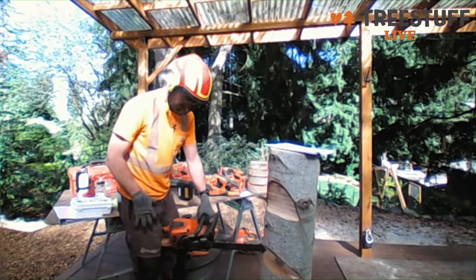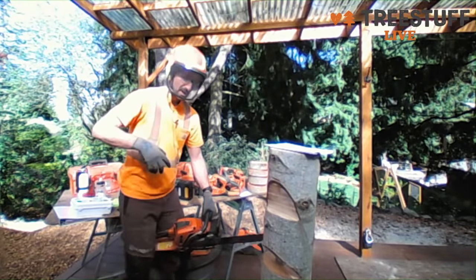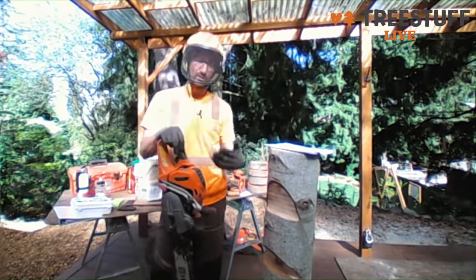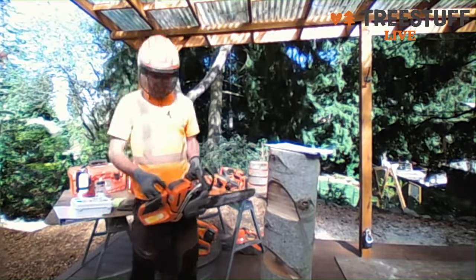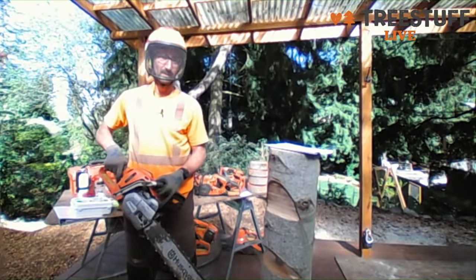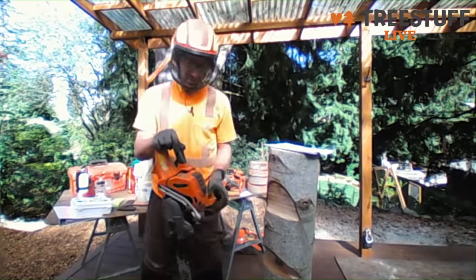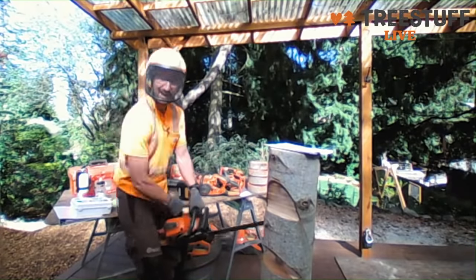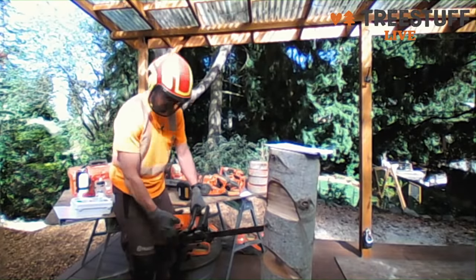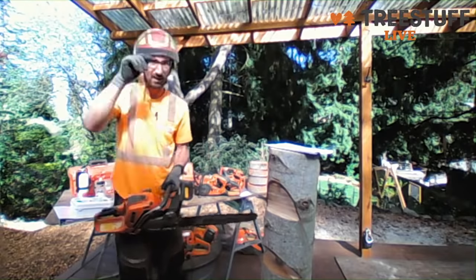So whether I'm starting on the ground or I'm starting standing up, setting up with good control and pulling with my right hand. And what I've found is sometimes it's mistaken for drop starting, because as I've gotten really good with those techniques, for me to start the saw, I'll set my choke, my chain brake. The saw starts pretty fast. It's not a drop start. The saw is secure between my thighs, held with my left hand, and I started it on one pull. Part of it's having a saw that's well maintained. And the other is getting really solid with your technique. So whoever asked that question about drop starting, thank you very much. A great opportunity to clarify.